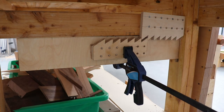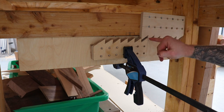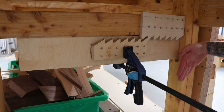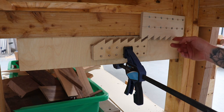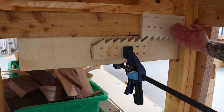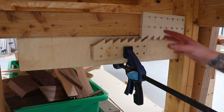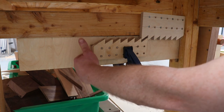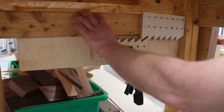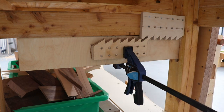The mechanism is clamped in place and everything is tested. You need to leave enough space that you have enough tilting action to skip the first set of teeth. As you go further out you get more and more movement - the further out you go, the more action you have and the tighter these teeth will close. I've put a half-inch spacer of plywood behind it to allow for the step in our 2x4 here so that everything is flush. Driving screws home now and we should be good to go.